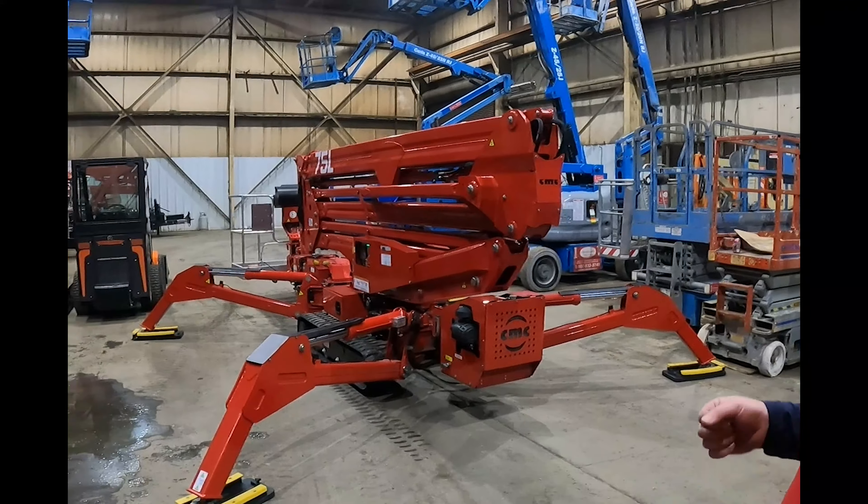So we're back level again while the machine's in the air. If you need to, you can run the tracks on one side or the other by operating the park button right here — hit the blue button and then run your track functions. That allows you to drive the tracks really well if your tracks are getting worn out and starting to slip, or when you're putting new ones on. It also allows you to clean the mud out of there pretty easily.